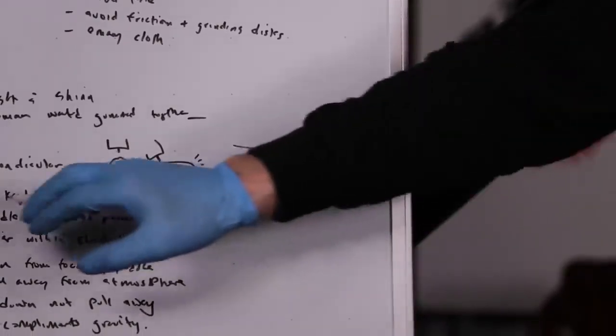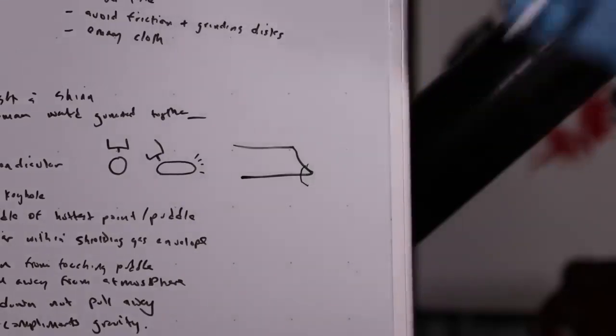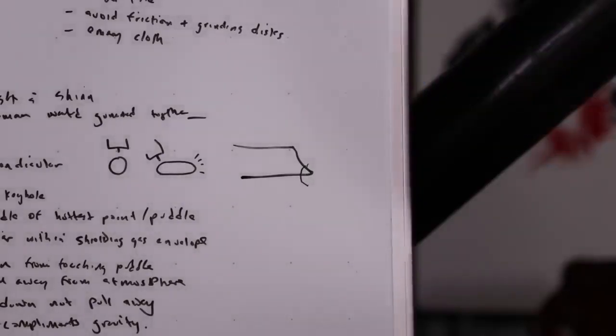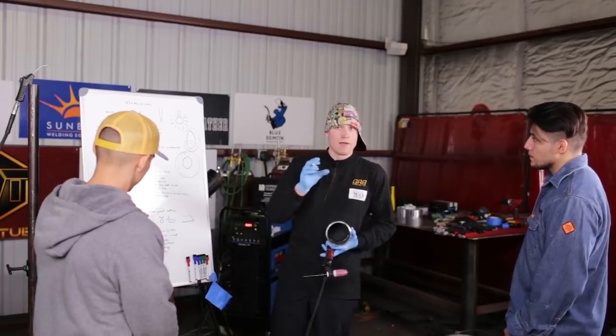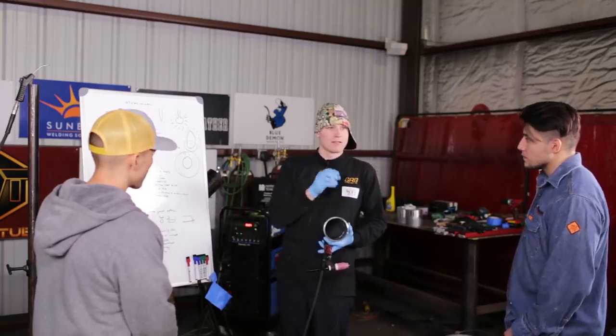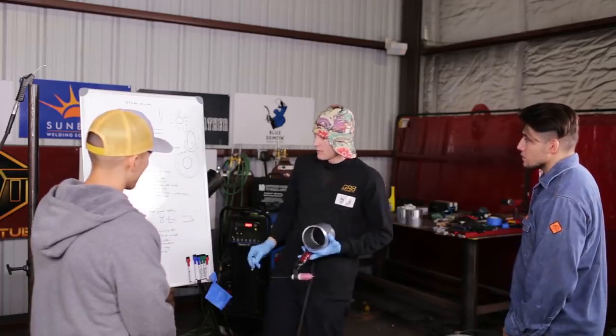Essentially, every time I open a keyhole, because that's what I'm going to be doing here, my torch is going to be on the leading edge. I'm going to be opening a keyhole, and I have to maintain that it melts one bevel tip at least 1/16, and it melts the bottom or the side bevel tip 1/16, and then I can dive into it. Unfortunately, if it's less than 1/16, then there's a chance that when I dab into the fill metal, the root pass might not even go in there.